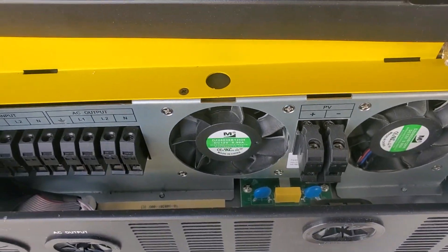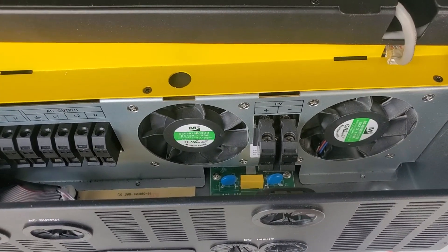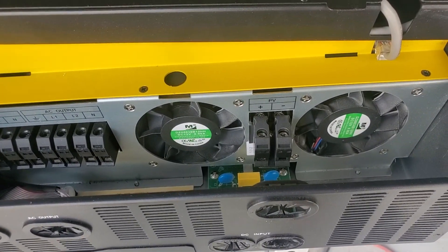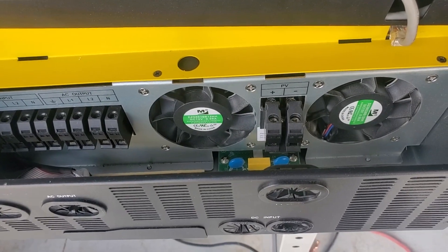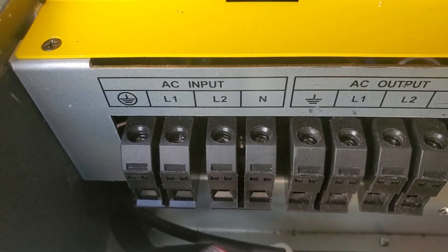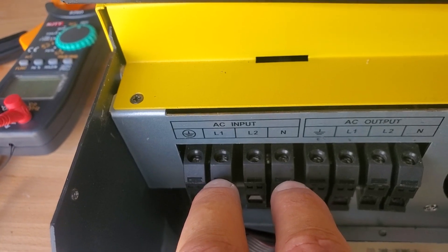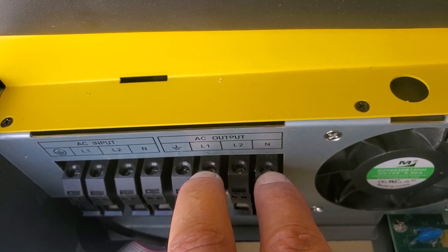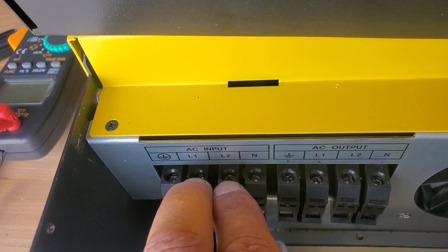Because we've got 450 volts input, the wires can be much thinner. At 450 volts at 10 amps that's already 4,500 watts. If we run at 300 volts with two sets of panels in parallel — 10 amps each — that's 300 volts at 20 amps, already six kilowatts. Also note this is a 240-volt input unit; you cannot put 120 volts in and expect it to charge the battery — it won't. It will only start charging at 240 volts. The output is 120 volts between live and neutral, and 240 volts between L1 and L2; same applies to the input.